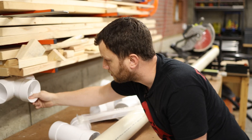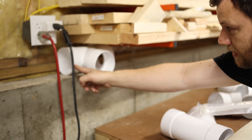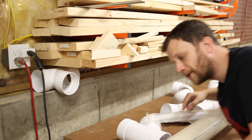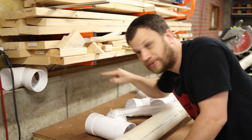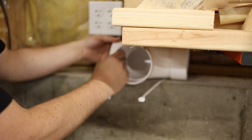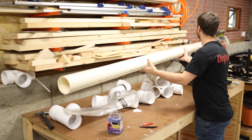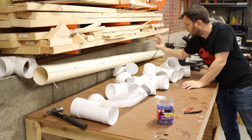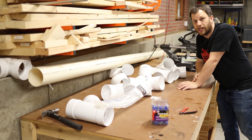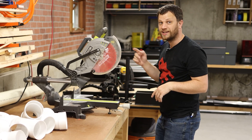I've got this three-way splitter here and I think I'm going to put it up like this — the dust collector will come in on the left-hand side. The first port will go to my table saw which is behind me, and then the third port will go down this long run along the wall. I want a dust collection port and blast gate in this area, so I'm just going to measure that out and cut it on my saw. This is going to fling tiny particles of PVC all over this shop — but this is exactly why I need a dust collection system.